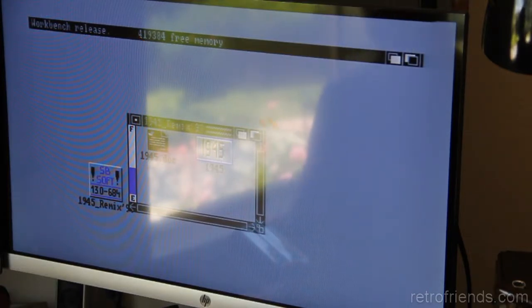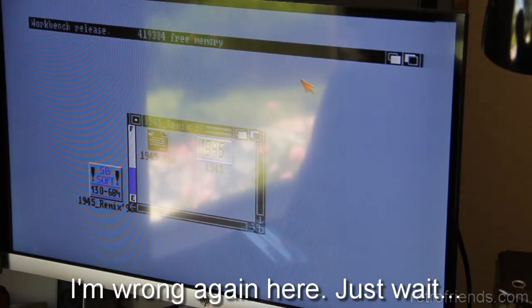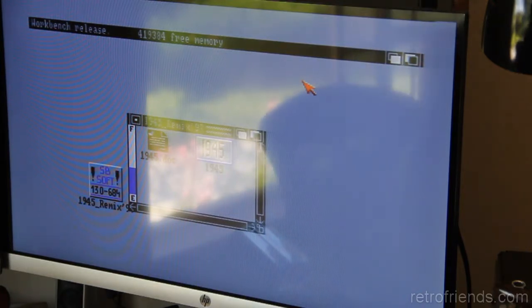Actually, I thought this thing was moving smooth, but when I move it to the left, I'm observing smooth movement on the wheel, the shaft, where the sensors are, but it is jerky. So I'm going to go ahead and see if I can get a replacement for that chip, because I don't think that's something the photoresistors are going to do. I think that's something the chip is going to do. I don't know, if the photoresistors aren't matched right, then I suppose it would cause this problem. I'm going to desolder that chip and see what goes.